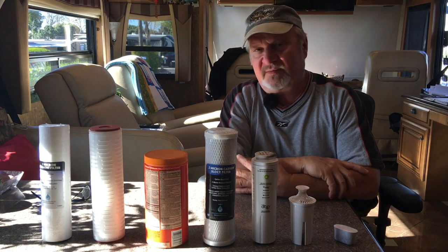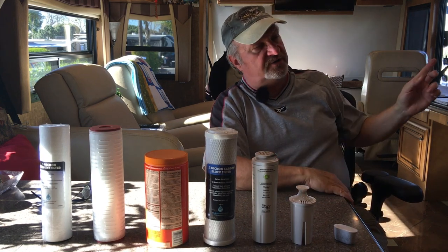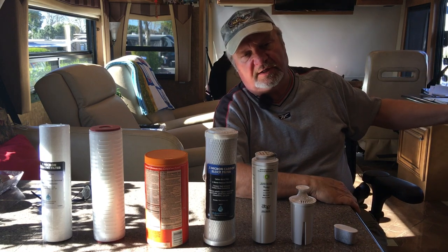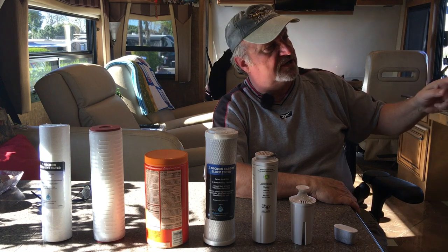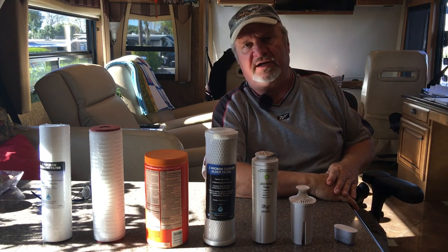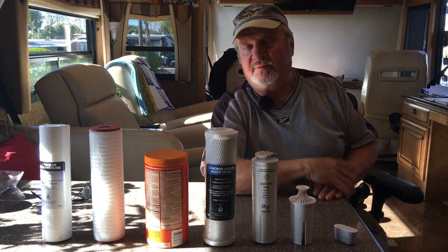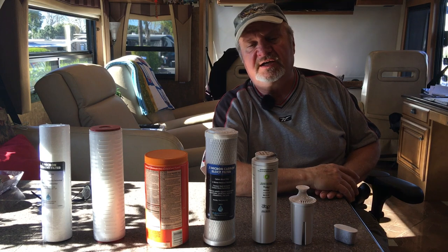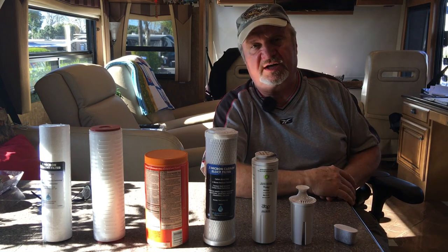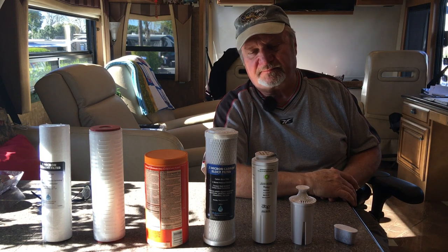Because I'm going to be sanitizing the water, the first thing that I want to do is make some water here, put it in my coffee maker, put some water in some jugs and things, because for a couple days the water is going to be chlorine-ish. We of course want to take any filters out in our system that we might want to be reusing, take them out for a while to get the chlorine through, otherwise you're just going to chlorine saturate that filter and then you're going to be tasting it.